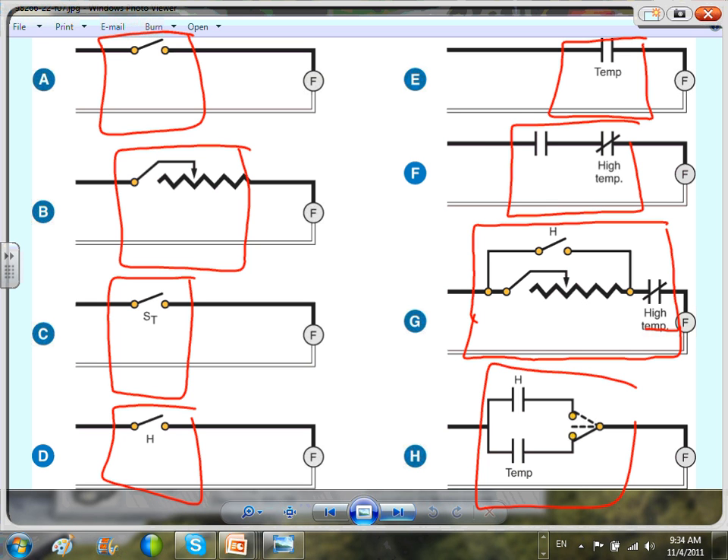What type of controller do you need? Temperature and humidity? Humidity only? Just a snap switch? A timer? As far as you're concerned, you bring the branch circuit in — using what the book says, 15 amp with 14-2 conductors. The controller could act as a disconnect if it has an off position right next to it — not just auto, but a true off position. Otherwise, you need a snap switch as your disconnect.